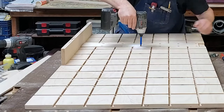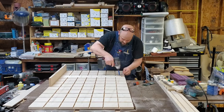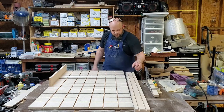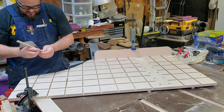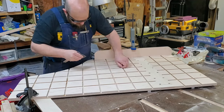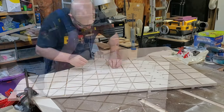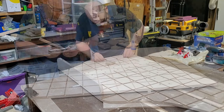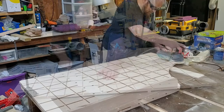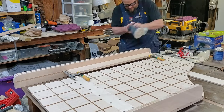Tightening up the T-nuts by using a screw to actually draw them in tight. Working my way down each one of those holes, making sure everything's getting lined out — now it's time to get them all put in. I'll do a final test. Now comes the fun part: all that sanding. I'm thankful I switched over to that Match Fit router bit because that dovetail bit really cut down on how much sanding was required. The sharp edges left from a normal dovetail bit definitely need to be eased over, so I'm spending a lot of time getting those eased by hand, trying method after method. Then it's time to buzz sand that with my Bosch orbital. Don't forget the fence — got to get that sanded as well. Everything's got to be smooth and clean.